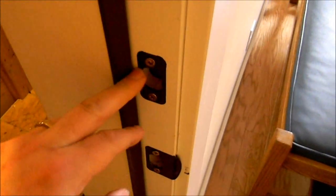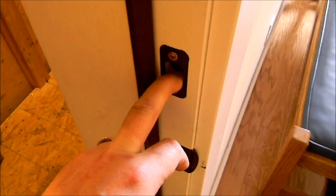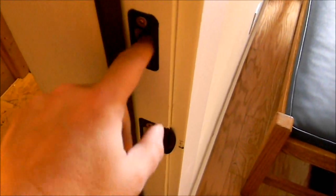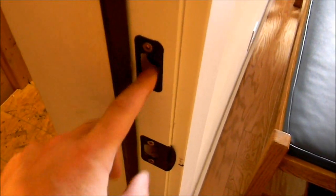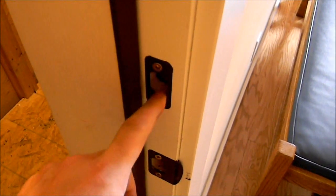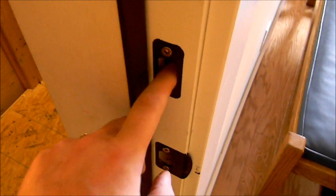This is a way to make your door one heck of a lot stronger and safer. There are also safety products where the plates are a lot thicker and heavier — a chunk of metal that goes in. You'll need a craftsman to put that in because you'd have to countersink and cut out the wood behind it. A good locksmith will have high-end security products like that. But this video was about simple things you can do yourself — we just unscrewed four screws and screwed back in four more.